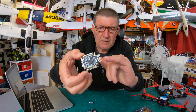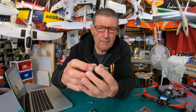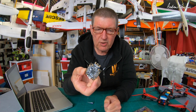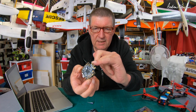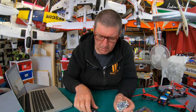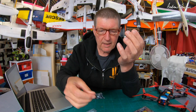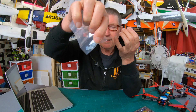There are two versions of this board. You can see this one has gaps in the battery pads, which means it's the BMP280 barometer version. There is also a DPS310 barometer version, which has a closed edge with just a hole for the battery pads. So just two options with different barometers basically. You also get a capacitor to smooth out noise on the power line, a top or bottom pad option, and six rubber grommets as well.